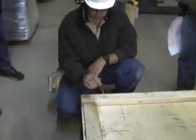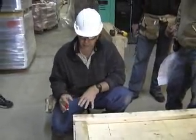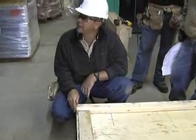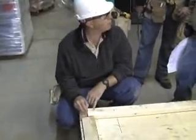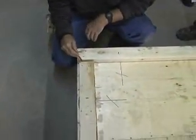So what we've done at this point is we've looked at our deck, we've ensured that it's level, square, and dimensionally accurate. The plates have all been cut, the long wall comes all the way out to the end here, the end of the plate is flush. We've left at least a good strong half inch gap up to five eighths — because when this panel skin drops down we'll seal it up with adhesive.